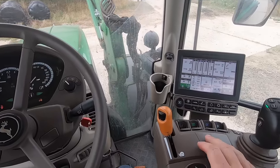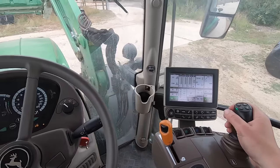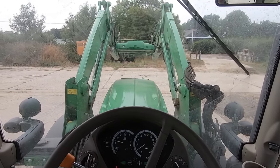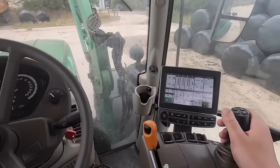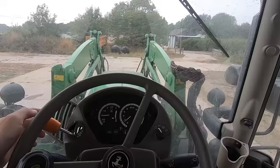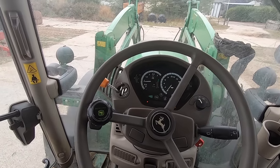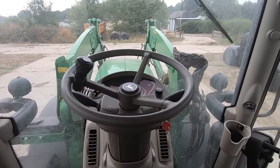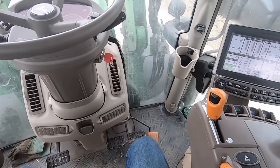That's pretty much it in terms of operating the tractor going forwards and backwards. I've got control of the loader on the joystick - that's how you load bales, stack things around the yard, or load a lorry. If I go into neutral and then into park with the shuttle, the tractor comes to a standstill with its handbrake on. It really is as simple as that - I haven't had to use the foot brakes at all.